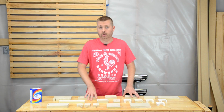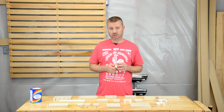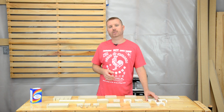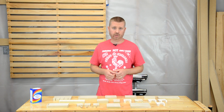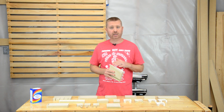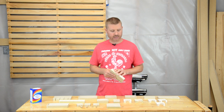Okay, first things first. You'll want to make sure that you've finished all of your cuts and final dimensioning of the pieces that you want to bleach. This is because oxalic acid has a fairly shallow penetration. So if you were to bleach a piece, and then say take a pass with a hand plane 2, 3, 4 times, you'll start to see the original color come back.